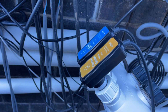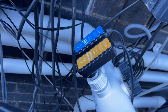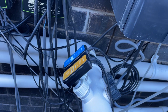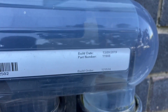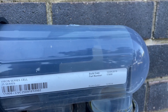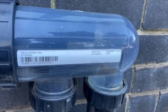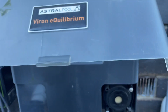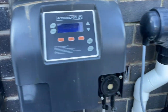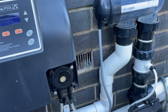When these are brand new and they start out, that's what you get. My issue — and these are expensive, they really put the price up way over what you'd get a good quality saltwater chlorinator for — is that two years on, have a look at this: build date September 2019. This is not old. We are April 2022 right now. It's a pre-COVID cell, just a couple of years old. The chlorine level, because of this automated system, should never be above about 3 parts per million. It's over 20 parts per million.